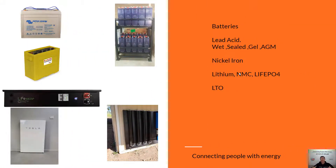The next thing — and this is probably going to be your biggest investment — is batteries. Batteries are complicated; there are lots of different batteries for lots of different situations, and it all comes down to your situation and what you want to achieve. Lead acid are good for small RV-type, motorhome setups — lights, TVs, fridges, really light loads. You don't want to run anything on them that heats or cools fast. Any high current draws over time will mean you'll be buying new batteries faster. They're still the number one selling battery in the world, used in every car on the road.